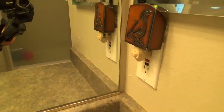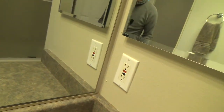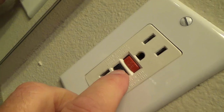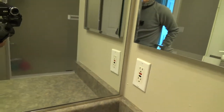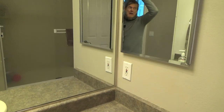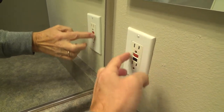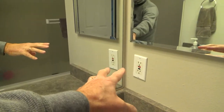As I go along, we're going to check something out. We look at this electrical outlet — this is a GFI. I'm going to pull this out here for a second. I'm trying to see if it shows what amperage it is, because here's a funny thing: lots of times, it might be a 20 amp breaker in your electrical panel, but maybe they installed a 15 amp GFI electrical outlet in your bathroom. And if they did, then you only have 15 amps of overall use as opposed to 20 amps.